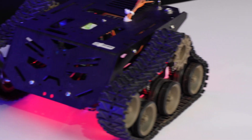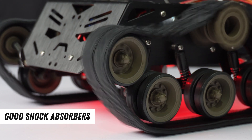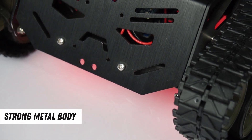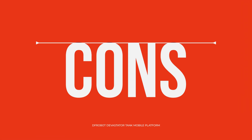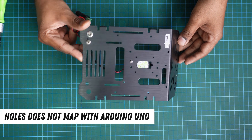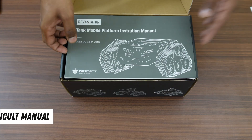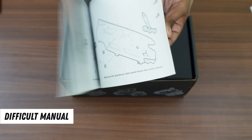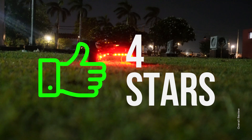Overall, the Devastator tank is a great pick for beginners, especially if you want to build robots with cameras, robotic arms, or other cool add-ons. The pros: the shock absorbers work really well, giving you smooth movement across rough terrains. The metal body is super strong and can even handle lifting small weights — very solid build. But there are a couple of cons: even though there are tons of mounting holes, there is no direct support for Arduino Uno, so you'll need a custom mount. Also, the manual is a bit outdated and confusing, so first timers might struggle. But that's why we made this video — follow along and you'll be just fine. In the end, I'd give this kit a solid 4 out of 5 stars.